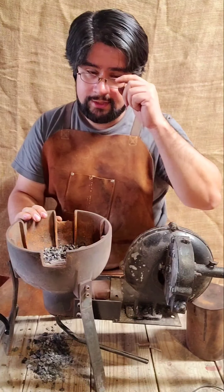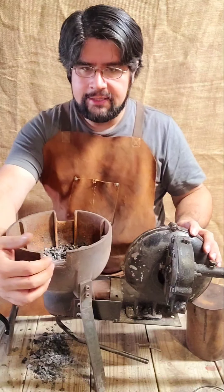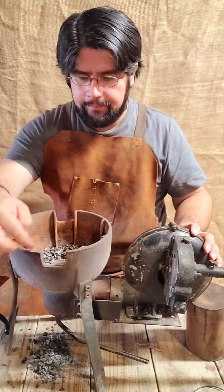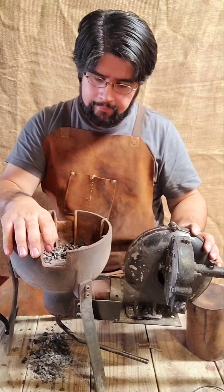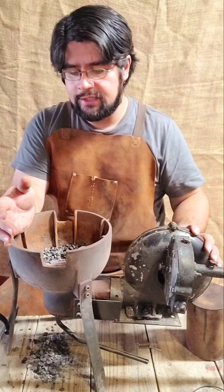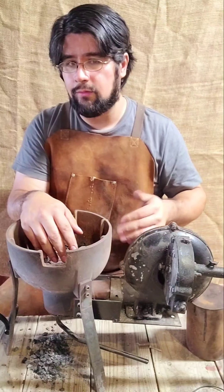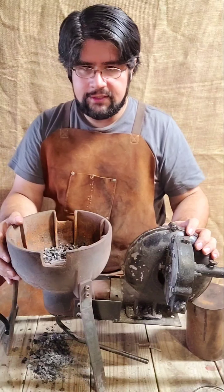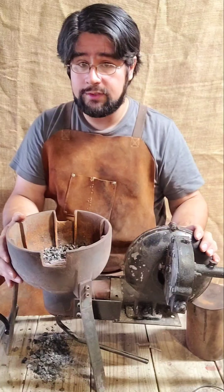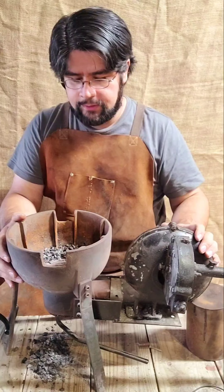The thing that drives me nuts is the pass-throughs are really small and they're very high — about an inch from the lip and about three and a half inches from the actual core where the fire is gonna be. That's a problem because if your fire is way down there and your work is way up on top, it's gonna take a while to heat up. I did some knives, some little stuff, made some tooling while I was there, and trued up a pair of scissors I forged out. It does the job, just not that well.